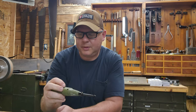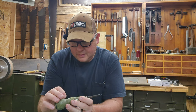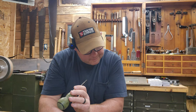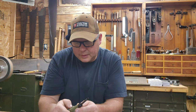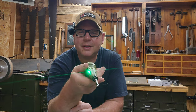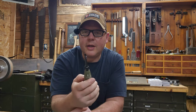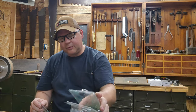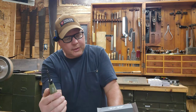It's forward and reverse, one speed. This here is the charging port — yep, there's the charging port on the side. This one is not USB Type-C, it's the older USB type port. I don't love that older USB port, but it's made in Japan so it's probably higher quality. Look at that green light on there — it looks so weird in the camera. If I'd had this in my dealership days, for dash work it would have been epic. So this one is 280 RPM, 2 Newton meters of torque.